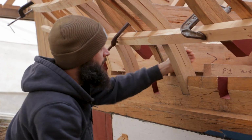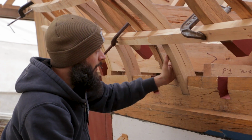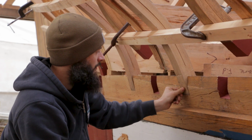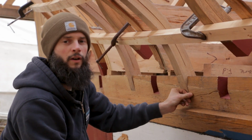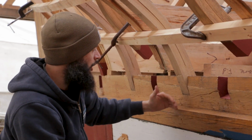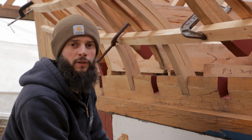So all we've been doing is popping this frame out and bringing that socket, just angling it back a little bit more. And we close up this gap in the back a bit, and we bring the frame flush, if not just a little bit in past the current bearding line here, or the back rabbet. And then once all the frames are in and that's all done, we'll go through and just clean up this back rabbet a little bit and bring it down to the depth of the frames.